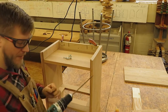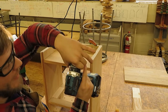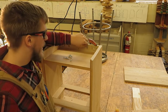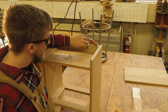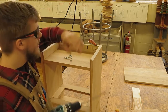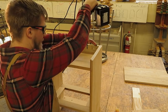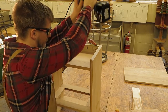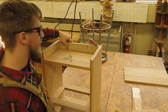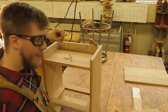With the drill, I'm setting the transmission to the screw function and dropping torque from maximum down to about 13. The reason is I don't want to strip the screw head — I'd rather the transmission spin and then increase torque to drive the screw in. I'll drive one screw on one side and then hop to the other so it doesn't spin out of alignment, and do a last check for any misalignment.